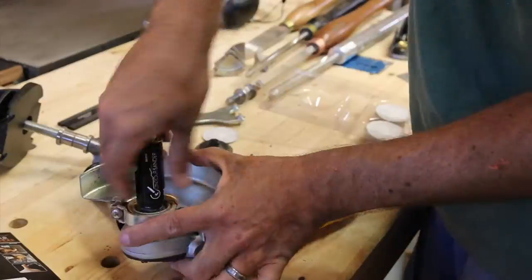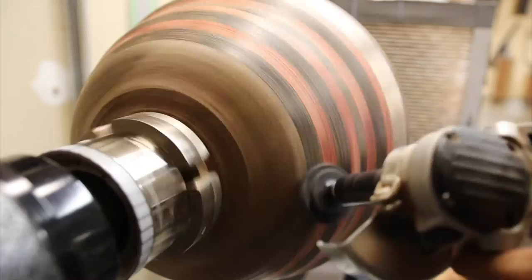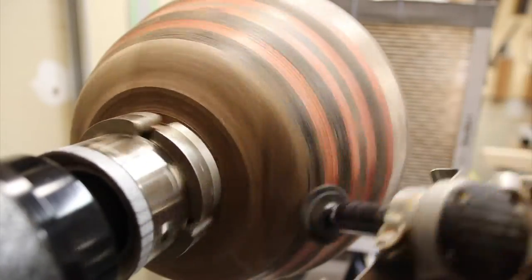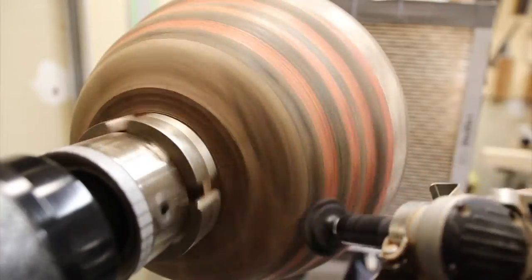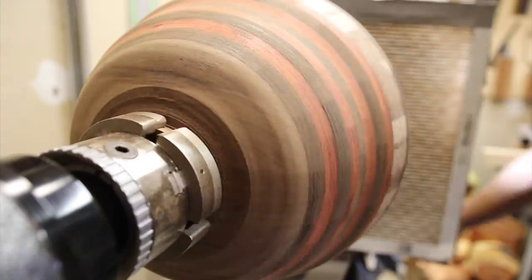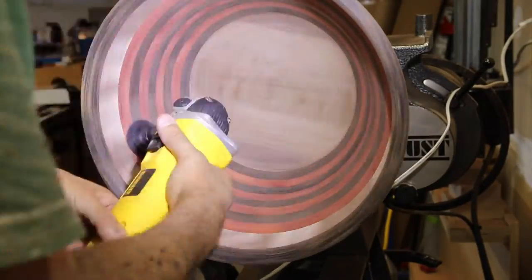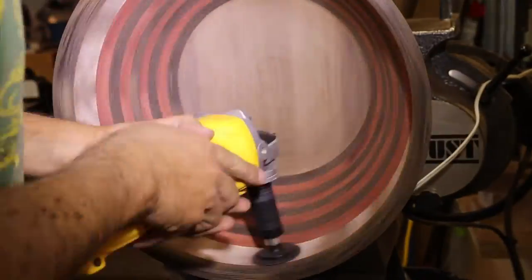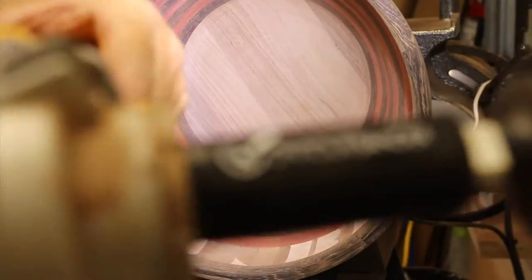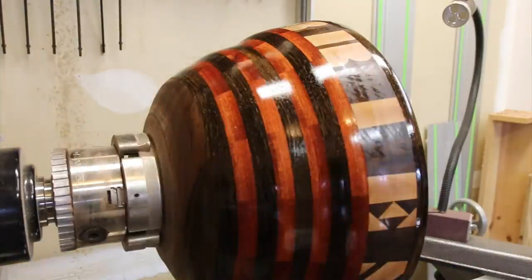Once you get it pretty close, that's when sanding starts. For this process I decided to use the Arbortech contour sander. I started out with 80 grit, and one of the good things about this system is that it goes all the way up to 600 grit. It also melds itself perfectly to all the aspects of the bowl because of the length of the extension. I also found that by removing the safety guard — which you might need for actual angle grinding operations, but is not specifically required when using it solely for sanding — it allowed me to get really deep within the bowl and get into every surface to create a perfect surface for the finish. Coming from using a drill that would often get gunked up, the angle grinder with the contour sander just worked great.